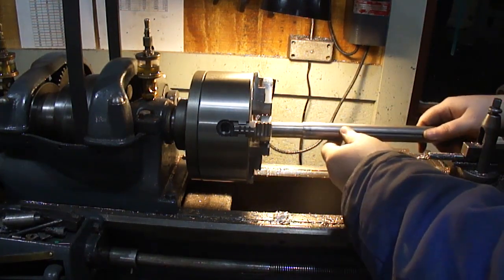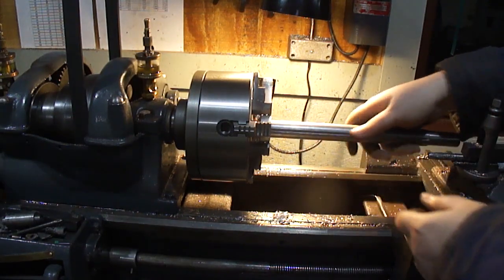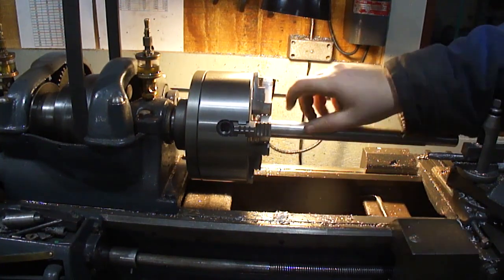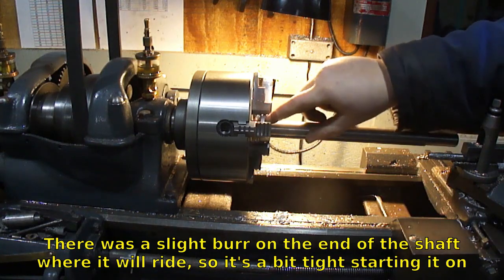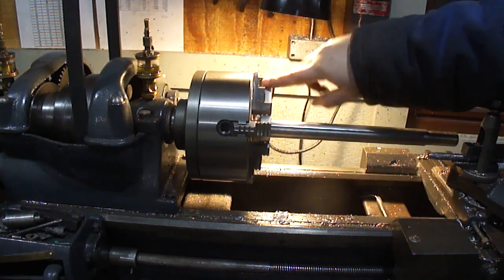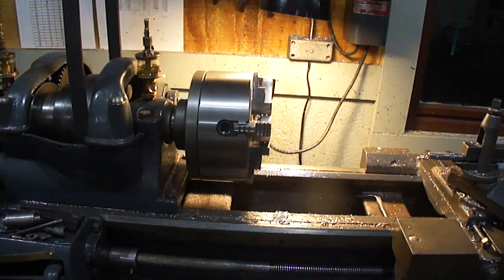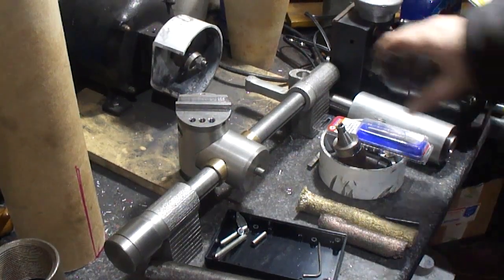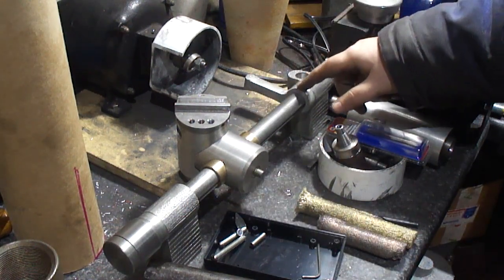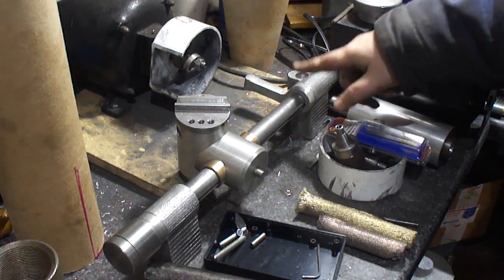Well, I think I got it polished out enough. It's a nice tight fit right there. It's got about 2 thou clearance so it can free move. So now I gotta just drill and tap for a 3/8 grub screw on the top and work on the micrometer adjust. Nice tight fit. Okay, it's a nice snug fit. I think the ends are a little bigger than the middle from polishing it, but it's so minute of a difference that it just, yeah. And it's going to live right here anyhow, so it's never going to change diameter.